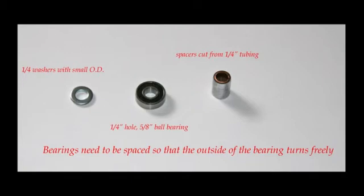There will be some duplication in this video, but you'll need other small parts. You'll need small washers that don't interfere with the outside diameter of the bearing, and you also need to make some small spacers. This video is just meant to give you ideas — you can do this any way you choose, and you can use whatever bearings you have on hand.